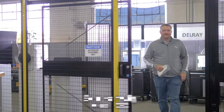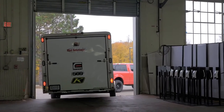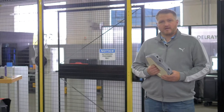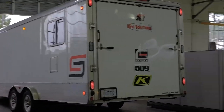Hey, what's up everybody? I'm Ben Hartwig, and today we're going to scan a snowmobile using the Artec EVA, which is a structured light scanner with 100 micron accuracy. We're going to use this scan to create some aftermarket components for the sled, like bumpers and seating and all sorts of different add-ons for the vehicle.